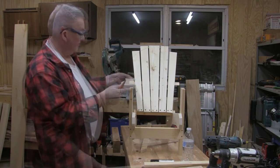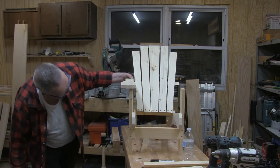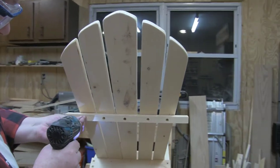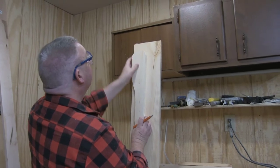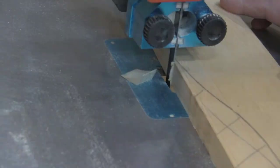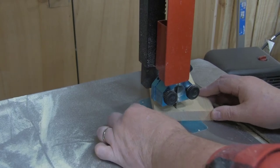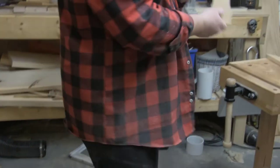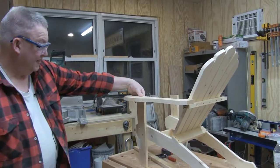That should look pretty — it's nearly there, just the slats and we're ready to go. I've got the back boards cut, the back support fitted, and those all screwed on. Next it was remake-the-arms time, so I used the old templates to create the new arms and then over to the bandsaw to cut them out. After that I offered them up to make sure everything fits nicely — doesn't look too bad, seems to be in the right place.